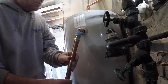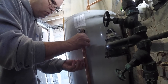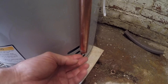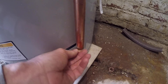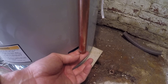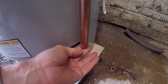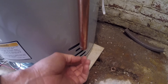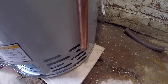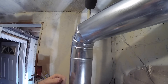An important item is your relief valve drop leg — it goes here, within 6 inches of the floor. The key point: there cannot be any threads on the end, because if a homeowner finds their relief valve dripping they could put a cap on it. This has to be a dead end of pipe. Some people use galvanized which has threads — a homeowner not knowing could cap it and cause damage, thinking they're doing a good thing. If it's dripping it's actually doing its job. No threads on the end of your relief drop leg, and the crimp always goes up and out so it doesn't leak carbon monoxide.